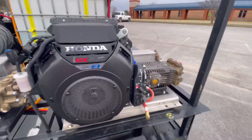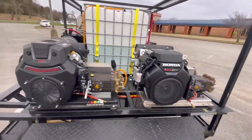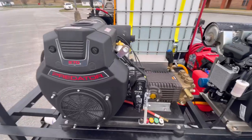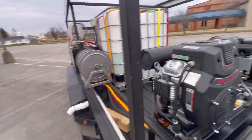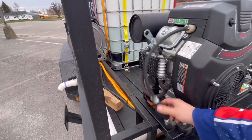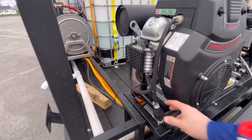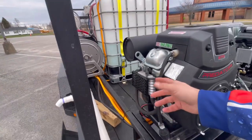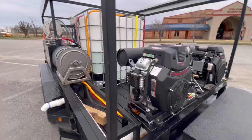We've got the IGX 800 and the TSF 2221 10-gallon-per-minute pump on that one — belt drive, Predator 670 — with the TSF 2021 8-gallon. Most people have trouble keeping suction and getting their pumps primed. Add one of these marina-grade fuel bulb primers onto your hose and you can prime it easily — it makes life a whole lot easier.